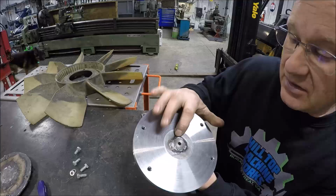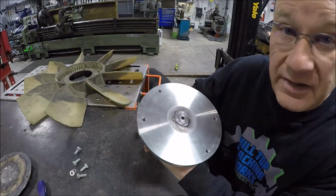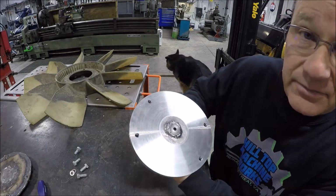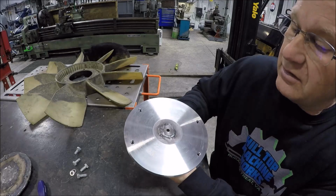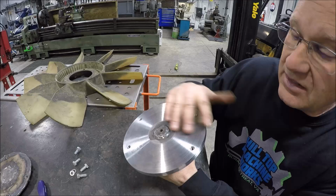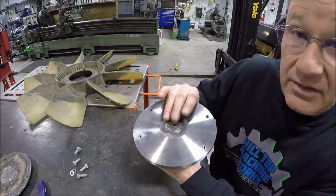If I hadn't overshot the bore there, a little bit of a bummer. But I guess what matters is how you recover, and welding it up worked just as well. The heat only gave us about 10 thou warpage, which is easy to clean up. So it still ended up being a win. Still not happy that I overshot it.